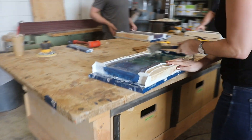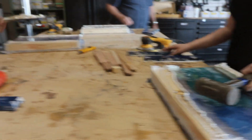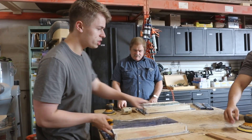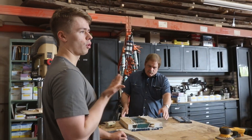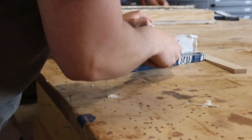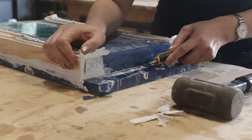So once you've got your ends off, you'll need to grab a wedge — just one wedge will do. You may also want to use an X-Acto knife to make it easier. What we're going to do is get the wedge in underneath to pry up our wall art piece. If you get the blade on your X-Acto knife, you can actually remove that bead of silicone that's in there beforehand, and it's going to make it a lot easier for your blade or wedge to get in there. Make a few cuts with the X-Acto knife, then take your wedge and pound it right in the end.